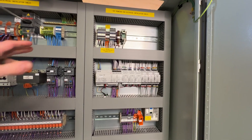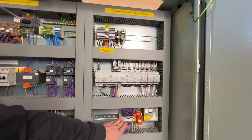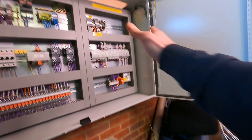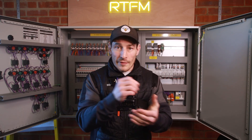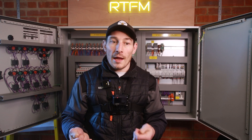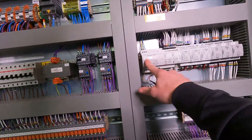Another thing is planning to have extra space within the control panel — not using up all your din rail space, so if you have to add extra terminal blocks, components, or relays you've got space. What I'd recommend is you create your bill of materials first, then plan out the layout — even if it's just on a scrap of paper. You need to know the sizes of everything going in, and this is where using CAD software like ProfiCAD or AutoCAD is really helpful.